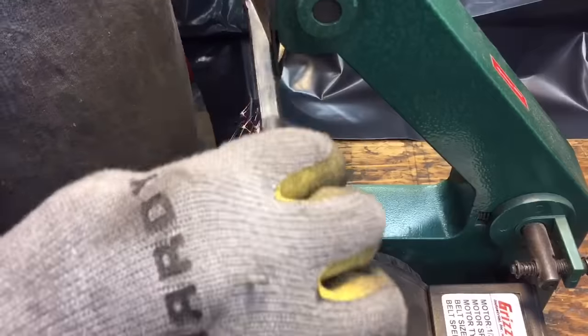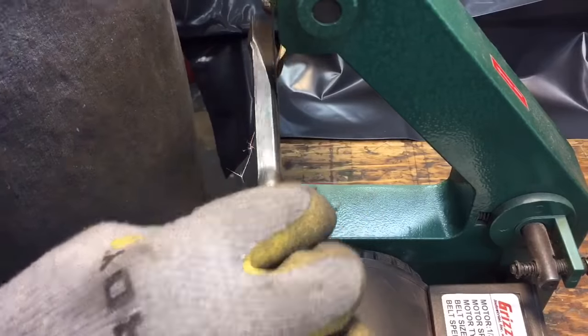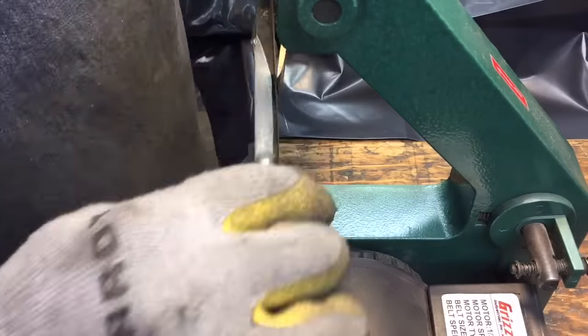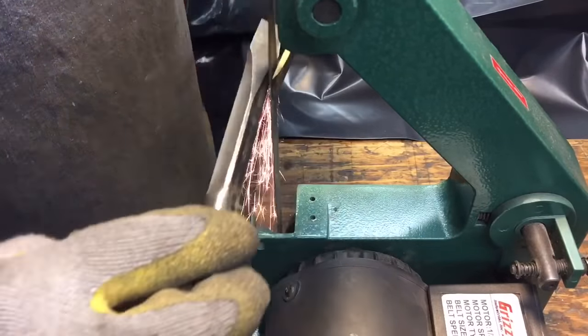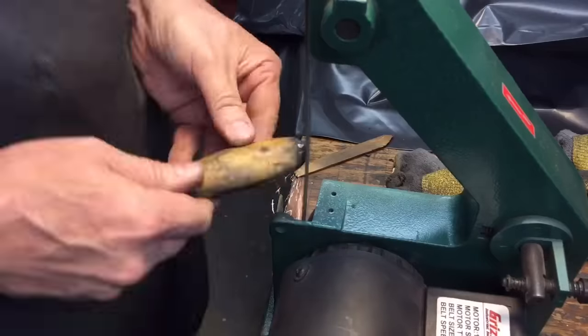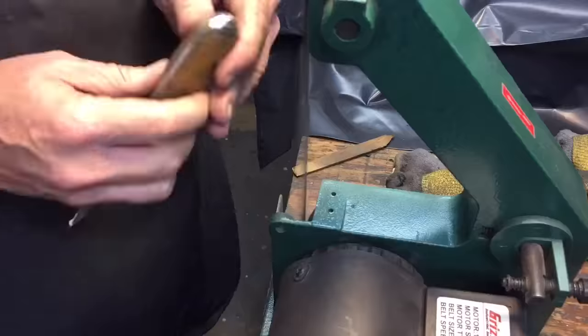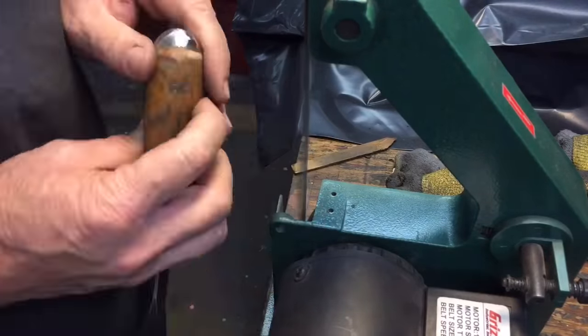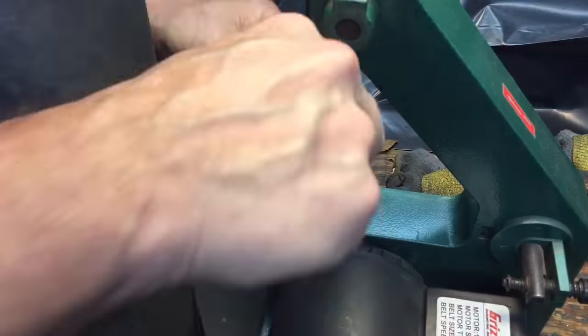Because this screwdriver is already hardened, the casting marks were very difficult to get out. I had to go with a little bit of filing in addition to the belt sander to get the marks down and out of there. After that we went to a finer belt and were very careful around the wood area because we didn't want to go across the grain and make it look like garbage in the end.